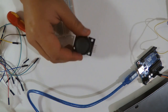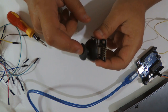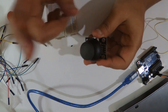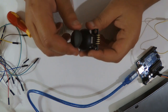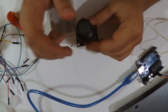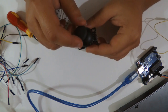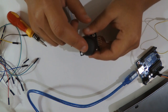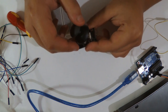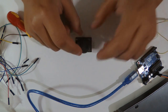The X-axis will control the horizontal servo and the Y-axis will control the other servo. The joystick contains two potentiometers that move from 0 to 1023, and the servo moves from 0 to 180. So we need to map from 0–1023 to 0–180. I'll do just a little multiplication or division for this. I'll leave the code link in the description. Now I'll wire the module off-camera.